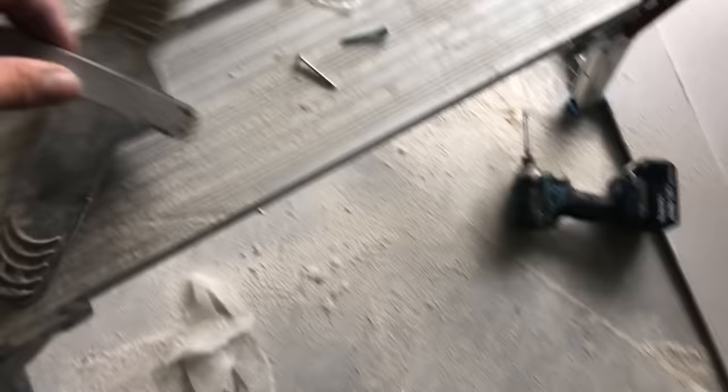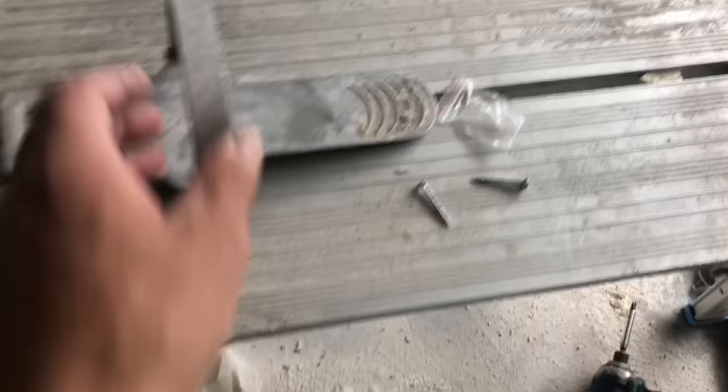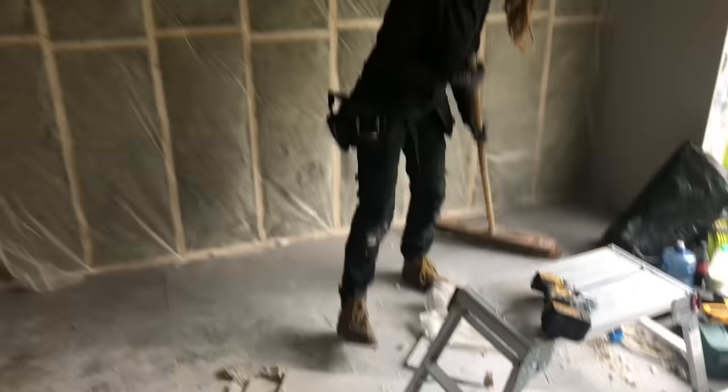Board lifter sticks on the floor, put on your board, pops the board up tight to the ceiling. So he's using the board lifter, or the accelerator pedal as we call it, to lift the board up. I'll put some screws in that now and it'll fix it.